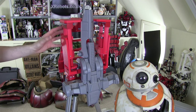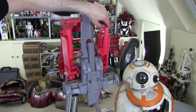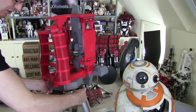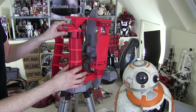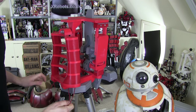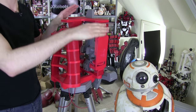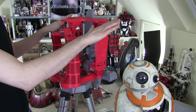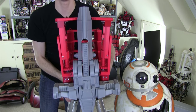Have a look at the video last time to see that demonstrated with this top plate. These are also coupled to the top plate with NinjaFlex blocks, again at the bottom. The spine that we've got here is also built out of NinjaFlex blocks, so all of these sections are quite flexible and they're actually segmented. I've got rigid ABS pieces in between, and those are held down at the moment with a tensioner — I've got some NinjaFlex filament just threaded through holes to hold that down. I've also got a pivot point here which allows this top plate to move either way as these actuators change length, so that's going to give me flexibility up and down and side to side.